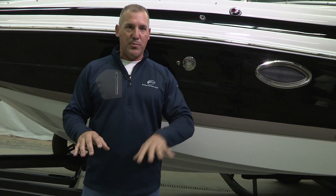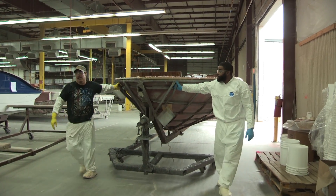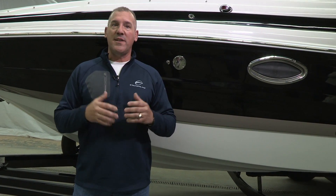When we create a new tool, we put three production molds into place — one in storage on the master, two into production. These molds are waxed, we shoot parts out of them, we laminate them, and we allow for a minimum 24-hour cure time before that part is pulled. Most of our competitors don't allow 24 hours. If you pull the part early, you get what's called post-cure — meaning the full lamination process isn't flushed out and the product continues maturing after it's pulled from the mold. That's visible when you look down the side profiles: you'll see a little waviness, the finish will be dull. That's post-cure — the part was pulled too early, or it wasn't waxed well enough, or they didn't use premium products. That's not the case at Crownline.